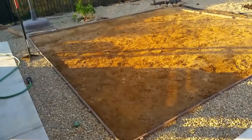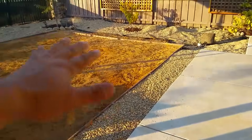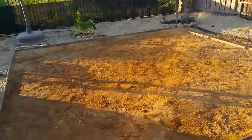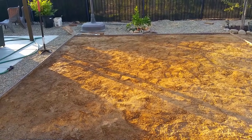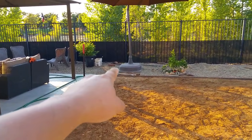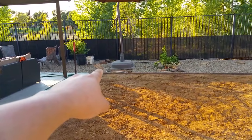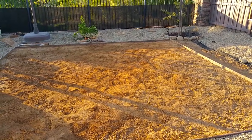I got my landscape border set up and a little bit of drainage plugged in here for the water to leach off and onto the gravel areas. They recommend five-inch nails. I did tamp this down to compact it — used the heavy shovel — and it came out to about four yards total.